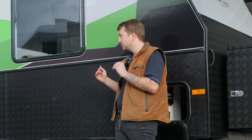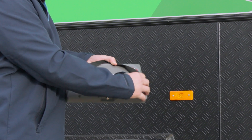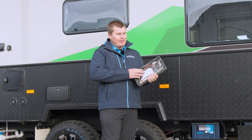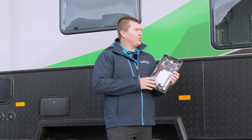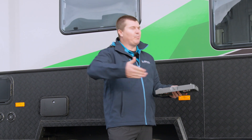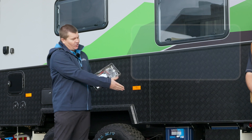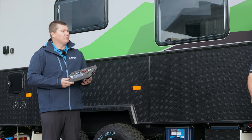You mentioned CAN bus — run me through it. All of our Zero range have these CAN bus ports. Cables come with the battery in the box. We plug battery to battery to battery to battery, which means all of our BMSs are now actually working together as a single unit, making sure they stay balanced, sharing the loads, keeping everything in check so that we can compound the ability to run more and more capacity. So yeah, 150 amp per battery — two of these together would run up to a 3000 watt inverter because there's 300 amp total current usability.